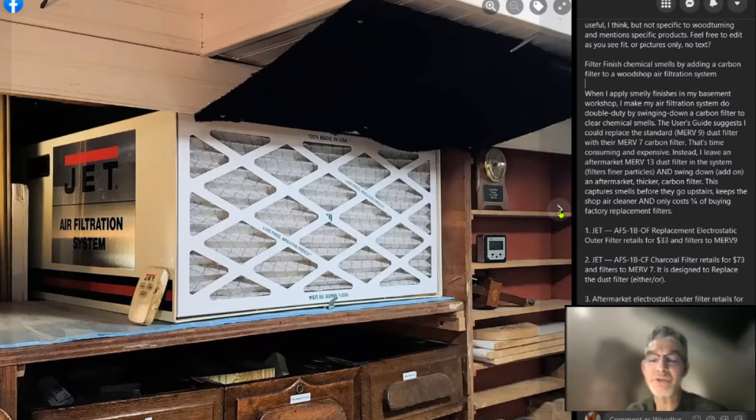So what I do is I turn my dust collector on, but I move the collector back away from the piece, maybe 1.5 feet or something. The shavings then go down and hit the floor, and the dust gets sucked to the dust collector, and it picks all the dust off. It makes a huge difference, both for breathing, I don't have to wear a mask so much when I do that, but also from dust piling up in the shop.